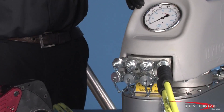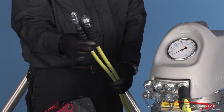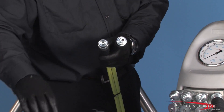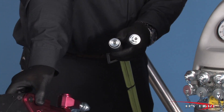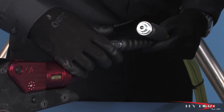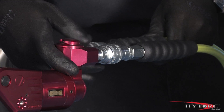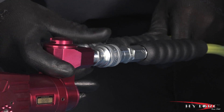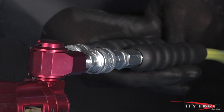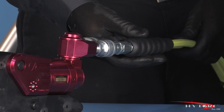The XLCT is powered by hydraulic oil from a pressure-regulated pump system connected to the tool by special high-test hoses. Note that both the male and female unions feature a small spring-loaded check ball which must be fully seated for the oil to pass. Ensure that the hydraulic hoses are firmly screwed to the tool's hose connectors using only finger-tight force. Even the slightest loosening of the threaded connector will shut off the flow of oil, preventing a high-pressure leak. Do not defeat this important safety feature by substituting other connectors that may not be rated for these 10,000 PSI pressures.